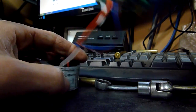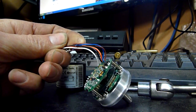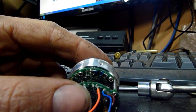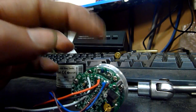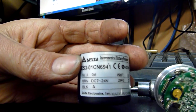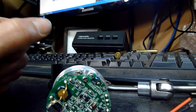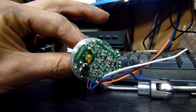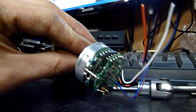I figured I'd show you this. It's kind of complicated looking, but basically there's an infrared diode emitting light to a pickup, and that little wheel that spins around there has very fine slots in it. So every time one of those passes and creates a shadow over the pickup, it registers that as one fraction of a revolution. There'll be a specific number of pulses per revolution that this encoder puts out. As you can see, there's a fair bit of SMD technology on here — I was just expecting a diode and a pickup, but this puts out everything, or processes a fair bit, then puts it out to the PLC.